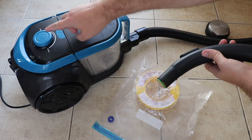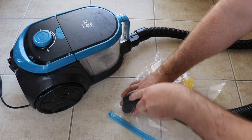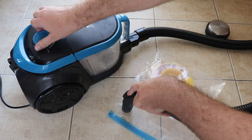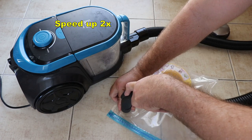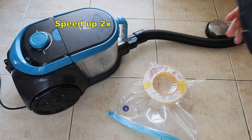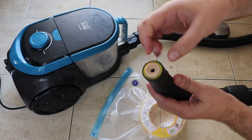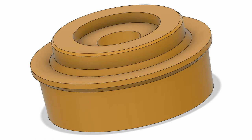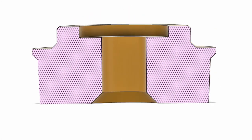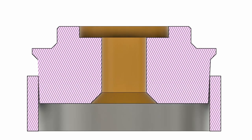Let's try it. I will start with a lower suction strength and raise it if necessary. Remember: don't do this for a long period because there is no air flowing to the motor and it may overheat. And it works! I will redesign this to add a shutter to prevent the adapter from falling in. In Fusion 360 I added a rim starting at a 45 degree angle so it can be printed without supports. If the adapter slips in, it will be held by this rim.